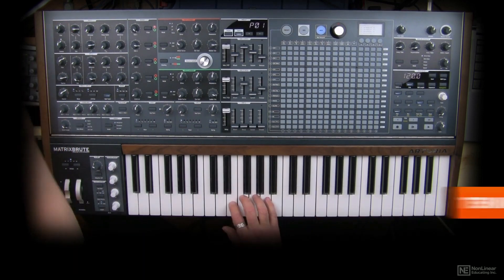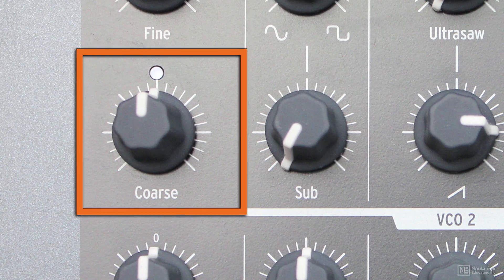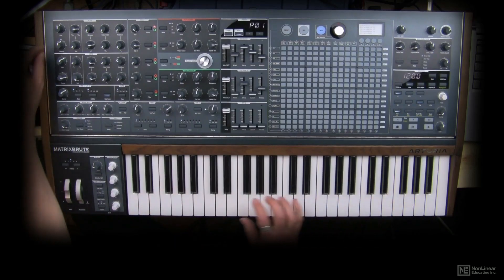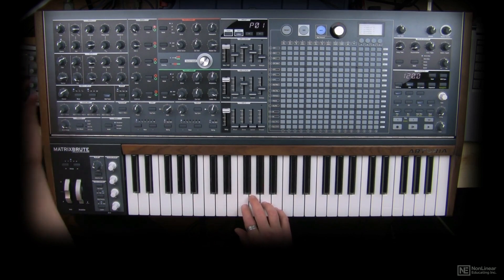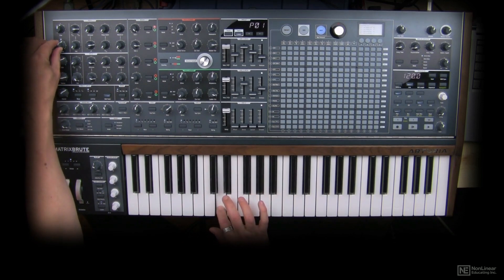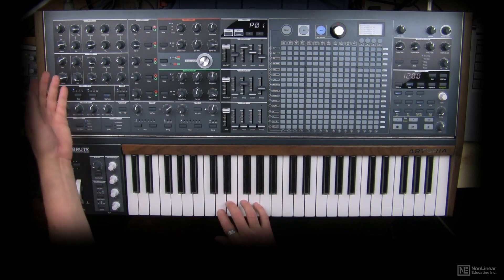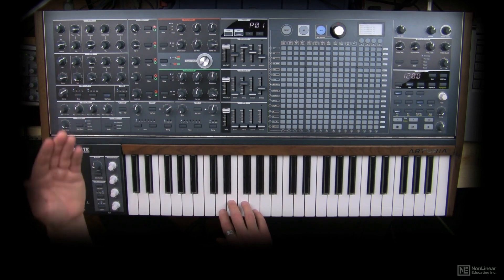Lastly, we have the ability to set the frequency we want for this oscillator. If we go to the coarse frequency in the center, we have these frequencies. As you go up, you will hear the frequency go up in half steps. When you hit the octave, you'll see the light come on, so it makes it really easy to change the frequency of this oscillator via octaves.